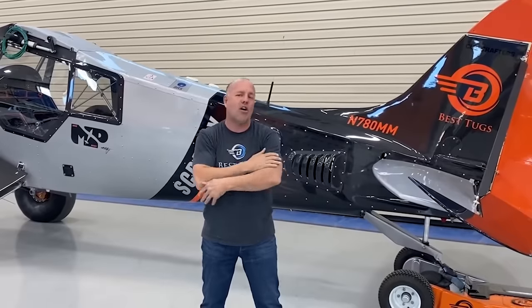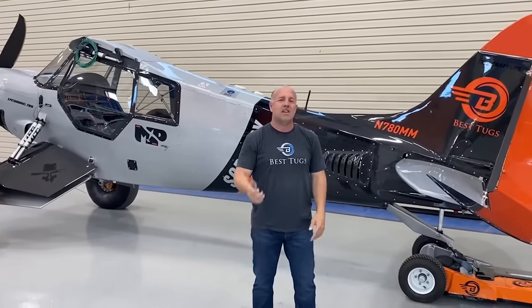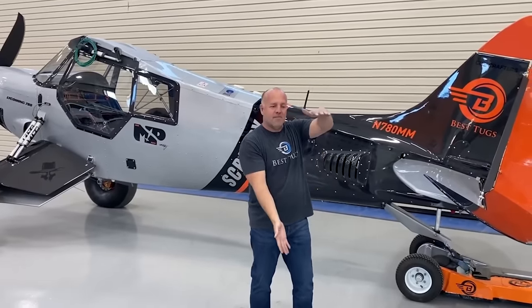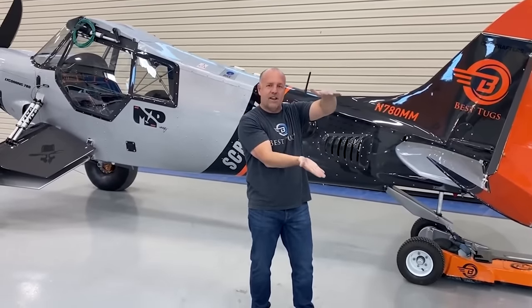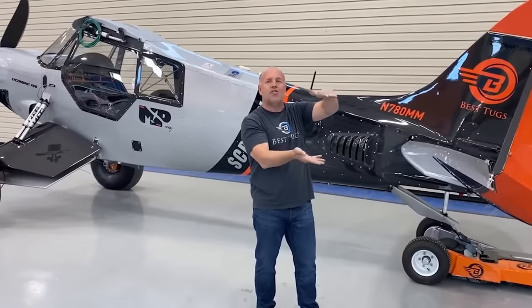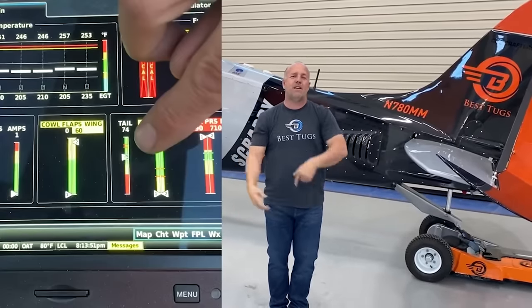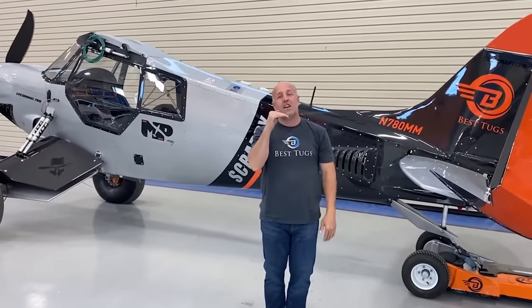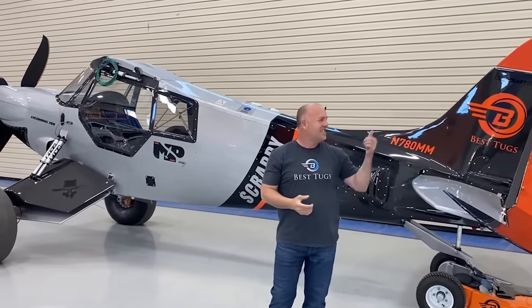And one time your tailwheel never shakes, and the next time it's all over the place. While doing the tailwheel suspension, I simply set it up so I can hit, level the tail, and it puts the travel about 3/4 of the way down, about 60% down in its position, and sets the tailwheel to level, and it has an indication line, tailwheel level. What's really great is I can load up people, throw fuel in, and reset it so that the tailwheel is always tracking straight. But what really got my attention is out here in the dirt.